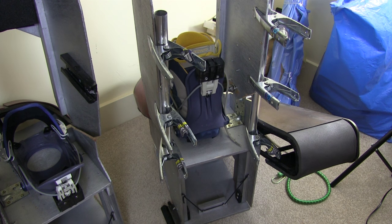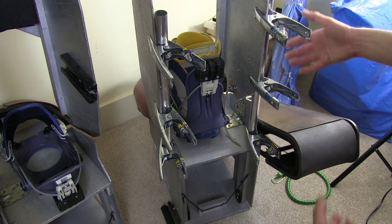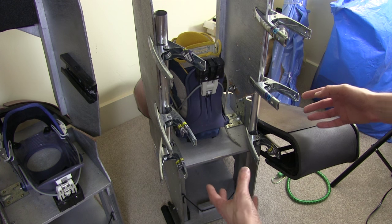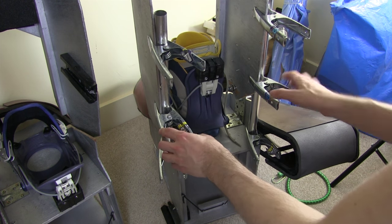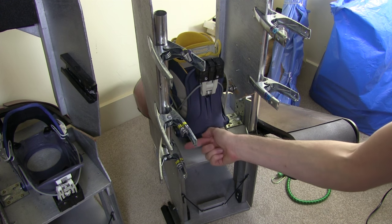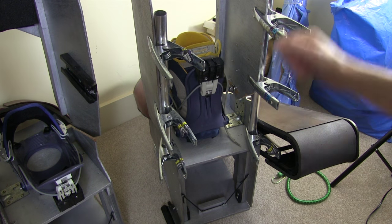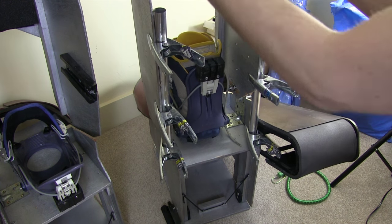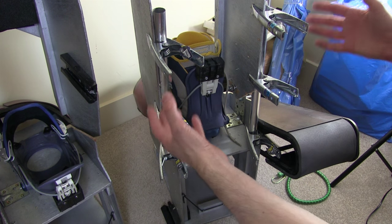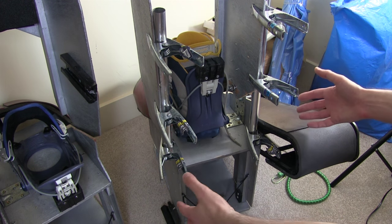What I need to do is devise a system whereby those three points can get locked, with a catch that either slides up or slides down. It's challenging because as well as not moving sideways, they actually need to not move up and down. So if they're sliding poles that drop down, they need to be locked at the bottom so they don't lift up and locked at the top as well. I need some sort of lock which is permanently attached, activated by cables from where I'm standing, and locks those three points in all directions.